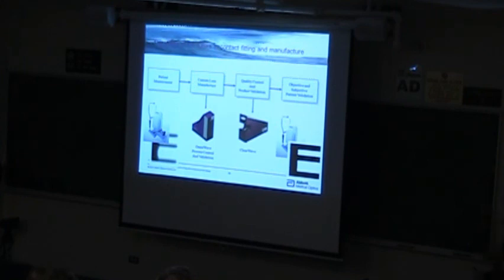So if I can program it for astigmatism, I can program for coma or spherical aberration, or really anything. I just have to have the information, have the registration information out, how it sits on the eye as well, which you can also get from those eye images. Once you make those, you need to be able to characterize the contact lenses themselves. And so we actually use the Shack-Hartmann to do that too. And you need about the same resolution to measure the contact as you do to measure the eye. So it's about the right tool for each one of those things. And then of course you can put it back on the patient's eye and see how well it worked.